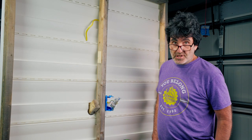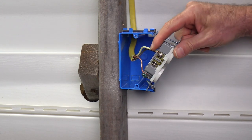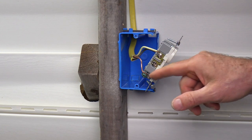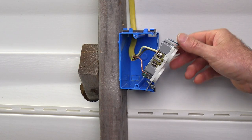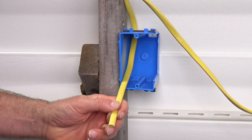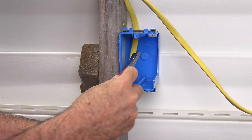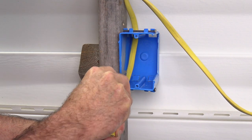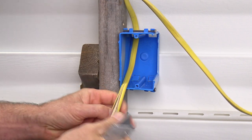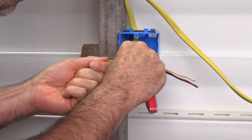Number four is another situation I've seen — not only are the wires too short, but the sheathing is barely stripped back enough to get the wires into the back of the outlet. You'll have all this sheathing in the box, making it really hard to fold everything back in. Instead, start with the proper amount of wire in the box, then take your knife and leave at least a quarter inch to three quarters of an inch of sheathing inside the box. Peel it right down the middle — keep your hand behind the knife — then peel it like a banana and cut the jacket off.